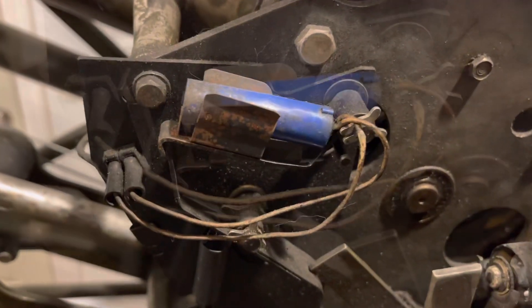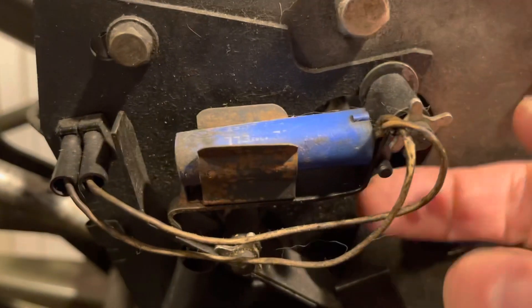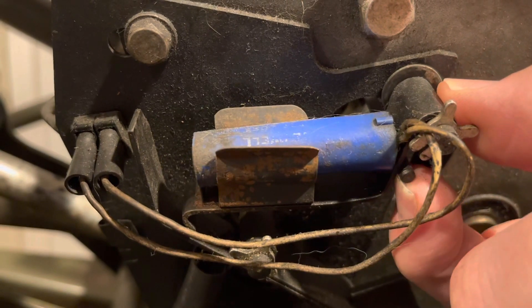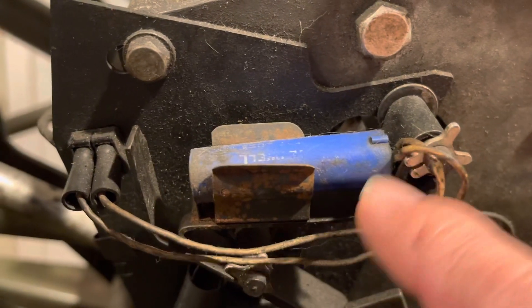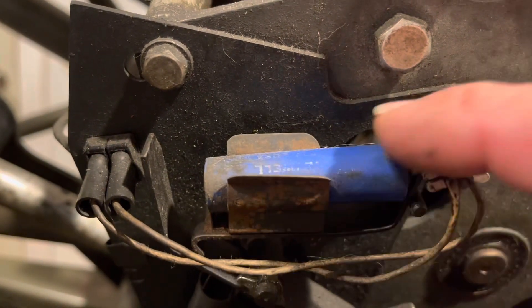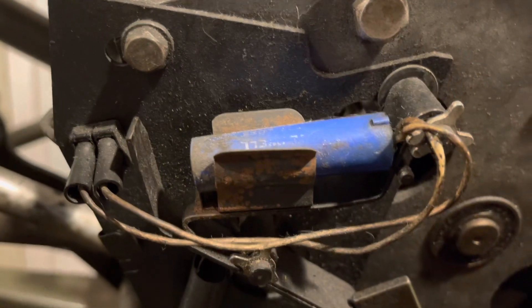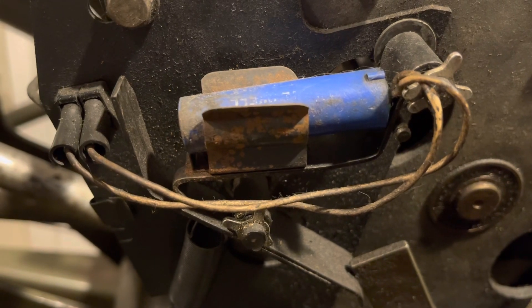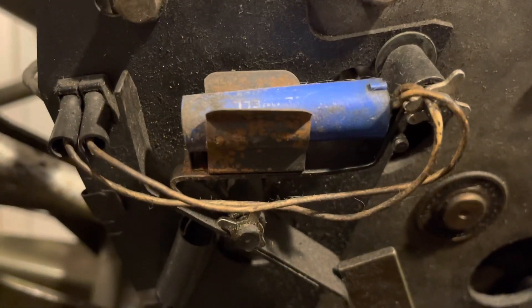This is where the mercury switch should be lit up. If your switch isn't leaning far enough down, it's going to flicker — only coming down about here instead of dropping out further. There's a pin sticking out the side of the detector right there. You can either bend that arm down a little bit, or bend this part down so the switch will angle further down. You need it to be down a little further so it has a complete circuit for the strike indicator to stay on. If it's still flickering, the wires on the back of the mercury switch may have broken and you'll need a new switch.